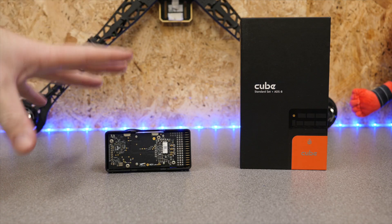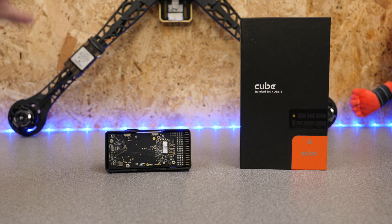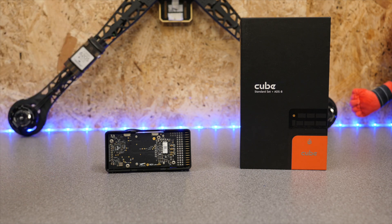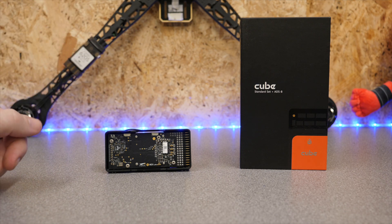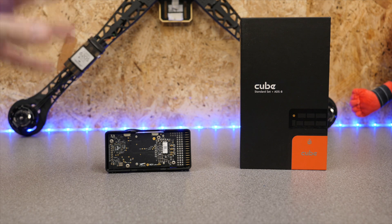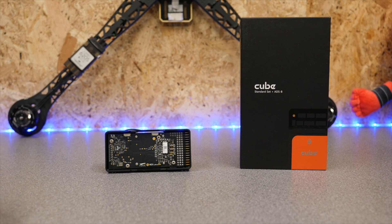I'm about to start a build with this one and I'm going to be doing a few more videos on that over the next couple of weeks. I'm going to be putting it into a hex and taking you through setting up ArduPilot on the Cube Orange and getting it all up and running. I wanted to do this video before I mounted it in the frame because it would be a lot more difficult at that point. If you're going to put this in a frame and use a canopy, make sure it is plastic and not carbon fibre or metal, but you do have that external antenna option as well.